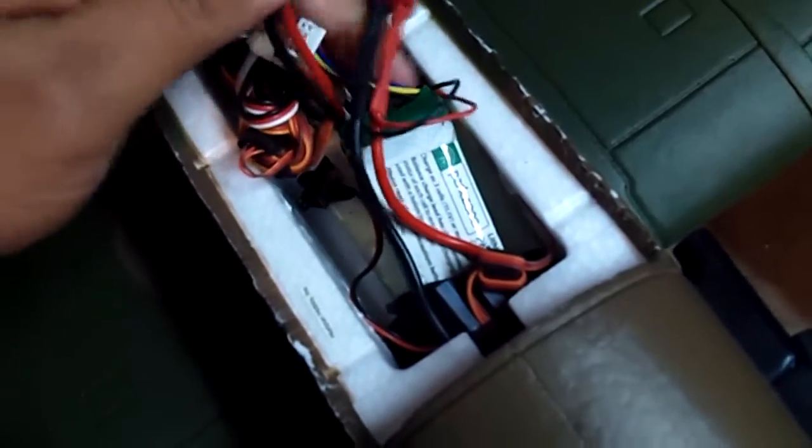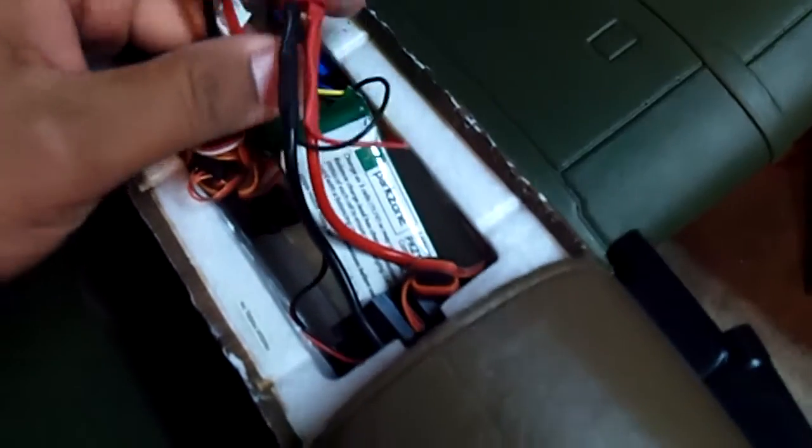The next thing you see is this isn't the battery that I'll be flying with. This is just a test battery that I had in there. You can see the giant wire bundle. Anytime that I have an extension, I use heat shrink around extensions. That's just a little bit more secure, so it doesn't pull out as easy when you're pulling on wires to make your bundles. So I do that.